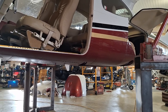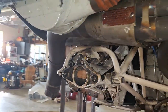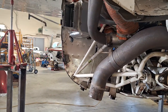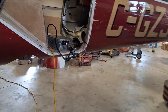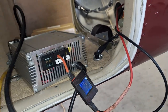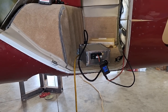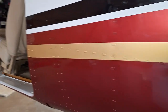The hydraulic pump has shut off. You generally wait a couple of minutes with the master on to make sure the pump doesn't cycle — if you have any bypassing in the hydraulic cylinders or a leak, the pump is going to cycle and it'll wear it out, which is not good. That would need to be addressed. Looking at the analyzer, it says it drew 24 amps, but there were other loads already on the battery since it was charging, so it's not a true indication. It's probably around 16 or 17 amps the motor was actually drawing, with a few other aircraft systems pulling power as well.